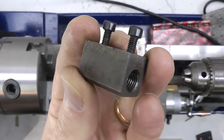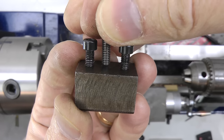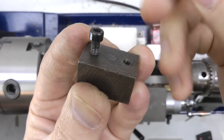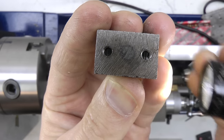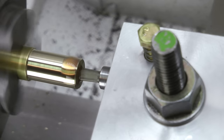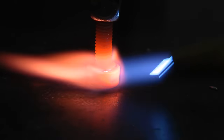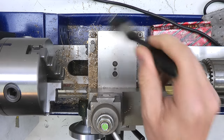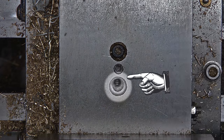The last job was to make an oiler for the cross slide nut. The nut is simply hung from two cap head screws that are adjusted for a position that allows full travel of the slide with no binding, and then the pressure from a central grub screw locks it in place. By introducing a small amount of tilt by having one screw tighter than the other, the backlash can be minimised. The nut is drilled right through to the lead screw so I reckoned I could use it as a lubrication point. I took an M6 cap head and an M4 cap head and silver soldered the top of one to the bottom of the other — that way I'd have a bigger cup to aim for to get the oil into — and then drilled a 2mm hole right the way through. With the screw removed you can see the threads of the lead screw down the hole.